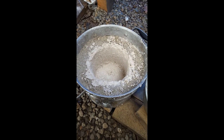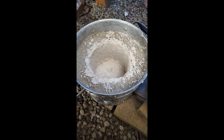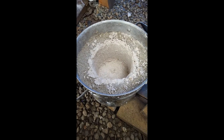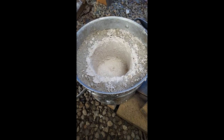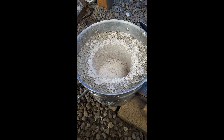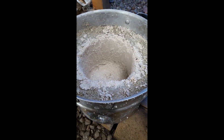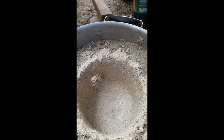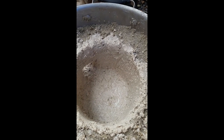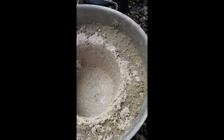So now this is the finished furnace. It needs to dry and be baked and everything still. You can see at the top it looks a little bit darker — that is because I ran out of refractory cement, so I used a bentonite-sand mixture, basically crushed up cat litter and sand, molded in above. There's about an inch to inch and a half of that above the rest. The rest of the thing is solid — the refractory mixture of perlite and refractory cement. This is the inside of it. You can see it's not super deep, but it doesn't really need to be because I have a very small crucible, and this will even fit a larger one.